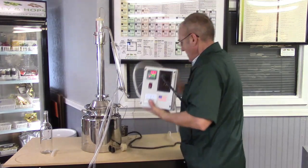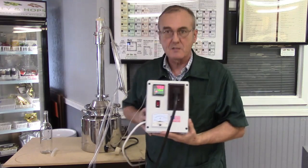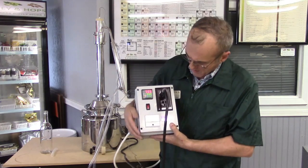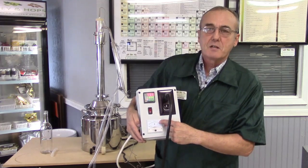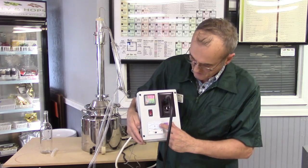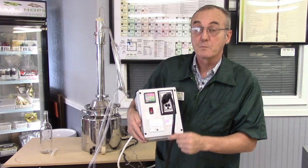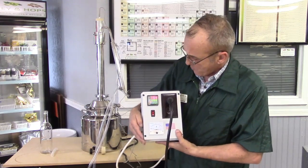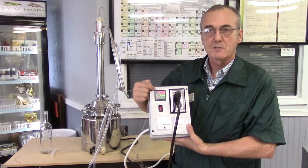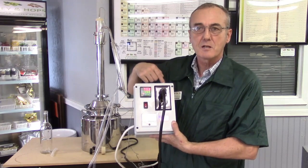Here's the PID controller, and I've got it plugged into 120 volts. This has only been on for about five minutes. You can hear it rumbling — 2000 watts is a whole lot of power. I've got an amp meter that goes from zero to 20, and it's at 16. Wattage divided by volts comes to 16.6 amps, and I'm right at 16 and a half — so it's correct. It's currently sensing 79.4 degrees Fahrenheit; I was able to change the TD4 from Celsius to Fahrenheit. I've got it set for 130, and you can see the light is on, indicating power is going through the solid state relay making it work.